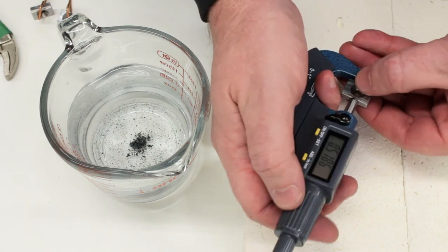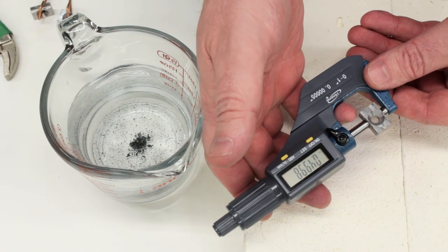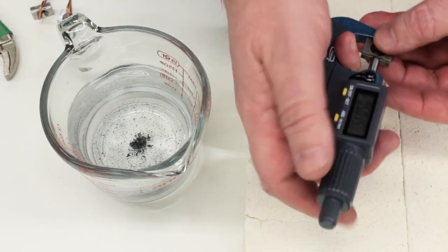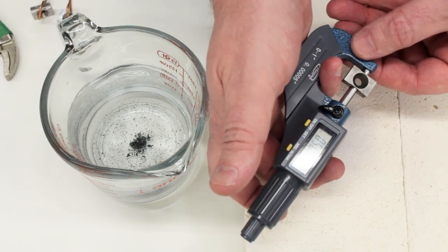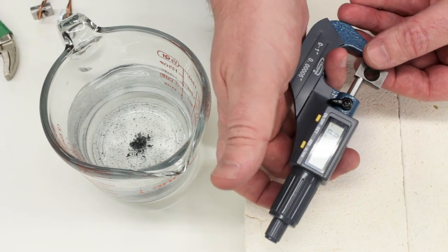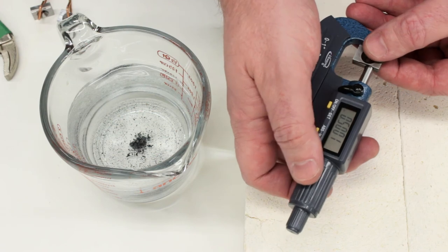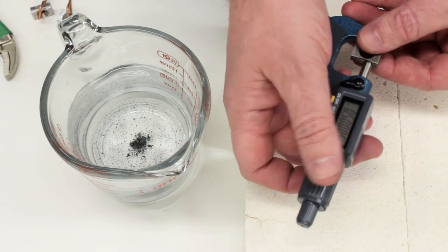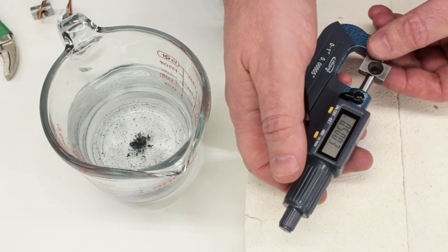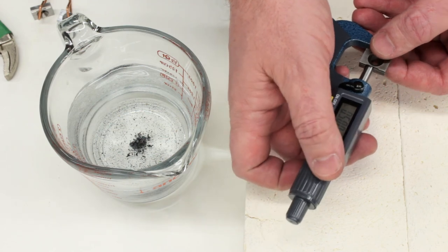This is one of them that's not been heat treated yet. And there's 499.8, so we're 2/10 under nominal. And this is 2.5/10 over nominal. So maybe a little less than half a thou they grew. There it's 1/10 over. Over here it's 0.5 over. So we should be fine. If we make the groove in the jaw 501 or 502, these should fit easily.